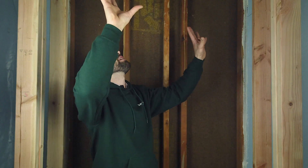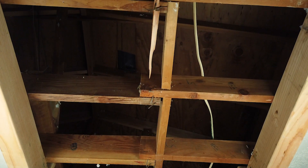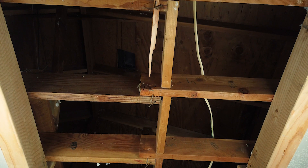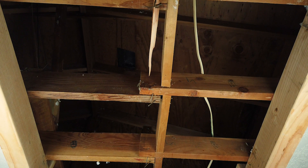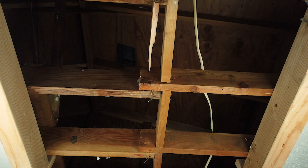As I look up, I'll tell you what I'm seeing. I'm seeing these ceiling joists that are two-by-eights, and they're broken on what used to be that wall. That's very common in a stick frame roof structure like this, because it's expensive — or impossible — to get a joist running all the way from one side of the house to the other, so they break them right on top of that wall. That means it's definitely a load-bearing wall. So if you climb up into your attic and you see those joists broken on top of the wall — overlapping like that — then it's definitely a load-bearing wall.